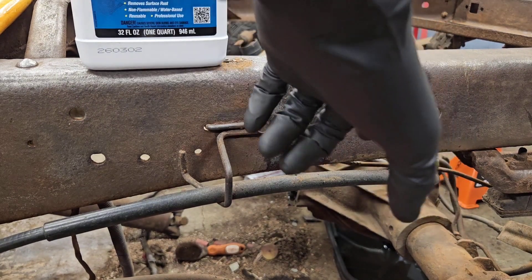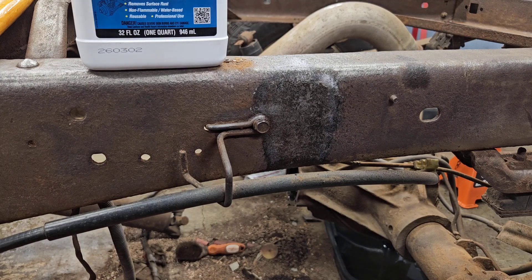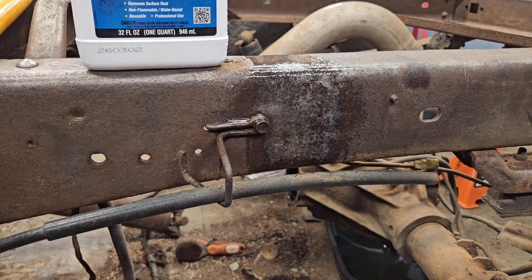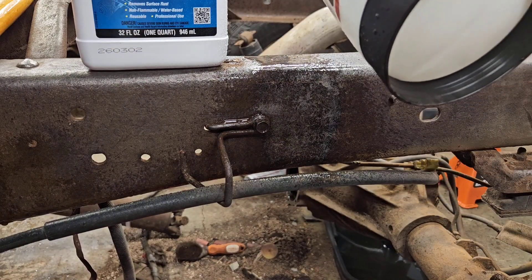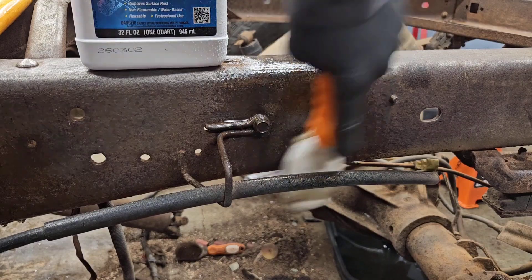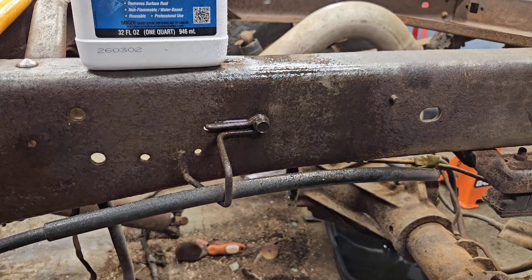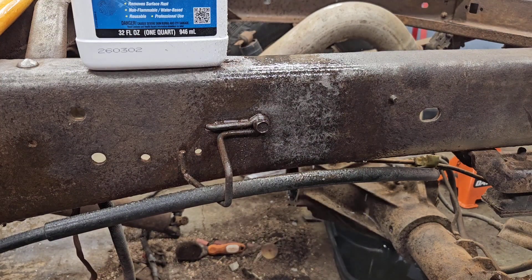We are now back here — it has been 20 minutes, which is following the directions. We now need to soak with water, so we are going to remove our acid-catching bucket and put our water-catching bucket back. We are now going to thoroughly soak with water as specified in the instructions. I am going to use a cleaning brush to scrub this metal to make sure we get all of that acid off, because phosphoric acid is not exactly safe for extended contact with skin or metal. We will dry this off with an air compressor and then see what it looks like.